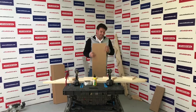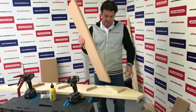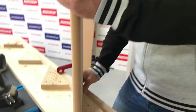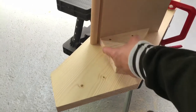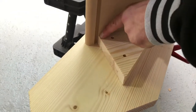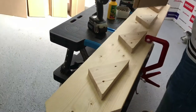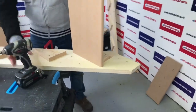The tread comes to make a 900-wide staircase, which I'm making. I just want to show you that this tread sits like this, so the front edge of the groove — or the back edge of the groove, whichever way you look at it — is flush with the block. That needs to go like that every single time you fix them. That's where it sits. So I'm going to just pre-drill.